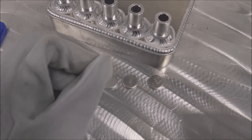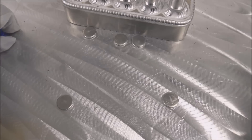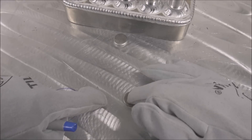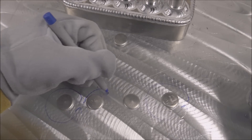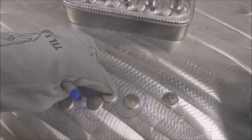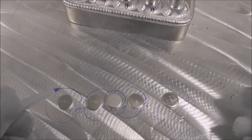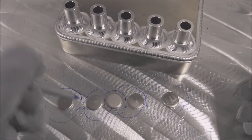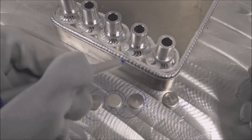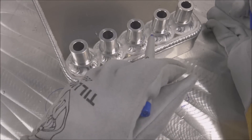It's very unfortunate that most engineers don't have real-world experience before designing parts. So what you're saying is: do the outside two first — easy, no obstructions — then these two, where you just have a starting point and stop point. That leaves the middle one to be difficult, stuffed in on both sides. No matter how you do it, they're not going to look symmetrical because you're fighting your torch angle on the difficult ones. Just do them all the exact same, get good at it, and all your stops are in the same spot without obstructions on the opposing side.